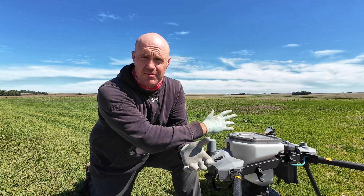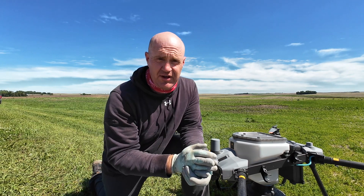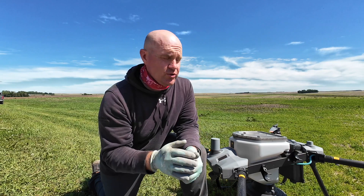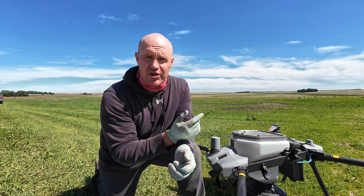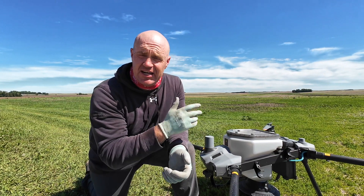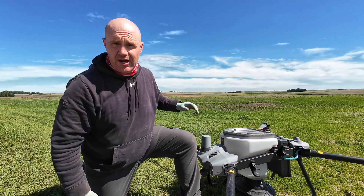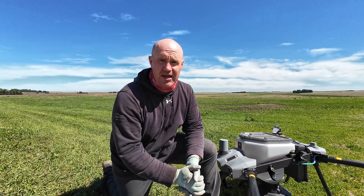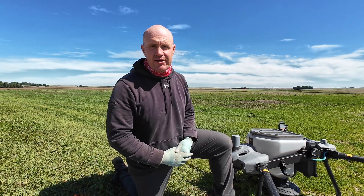If I had a tender to use bulk fertilizer and just dump 50 pounds at a time that would help. My batteries — I'm grabbing from a pole on a 50-amp camper plug. The batteries are totally fine; it's just a matter of shuttling them. I'm getting two, three, up to four missions per battery depending how far I have to go before swapping. I came in with 50% battery. I have the low battery warning set at 30%; it'll auto-land at 5%. With a quarter mile to fly back, I start returning at 30% — I've come back with 40 pounds of material still aboard rather than risk landing it out in the field.